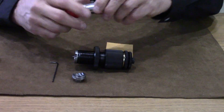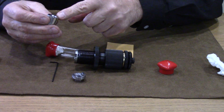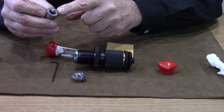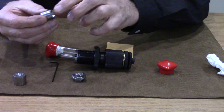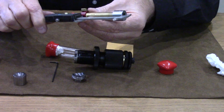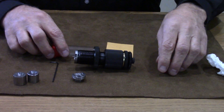The Allen wrench is also included. The additional neck bushing included with the die is made specifically for you and also includes the shoulder. So not only do you get the entire neck sized — some other bushing dies only size about 80 to 90 percent of your neck — you'll get your entire neck sized here and it'll register off the shoulder. They also included a little fixture so I can measure my shoulder: it simply slides over the piece of brass and I use my caliper to measure before and after sizing to see if I'm getting the desired shoulder pushback.